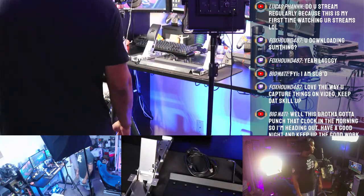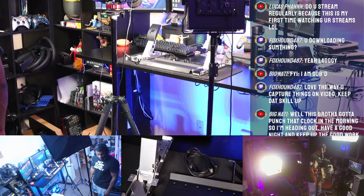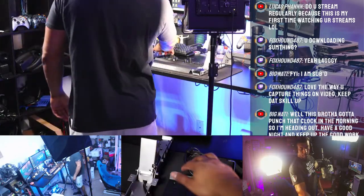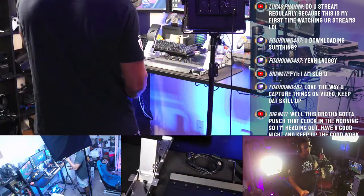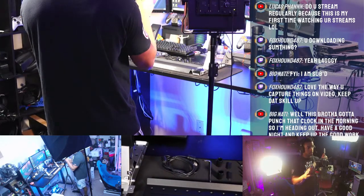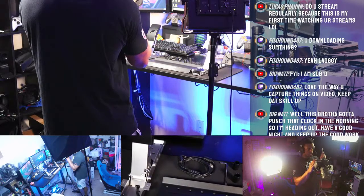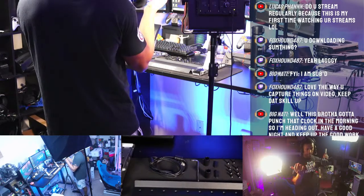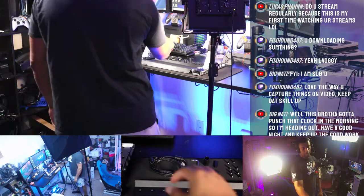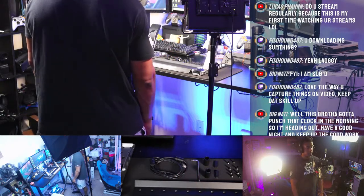One thing that has been a big problem for a lot of people in sim racing is dealing with EMI, electromagnetic interference, also grounding issues of rigs. You've got often very high powered motors with high powered magnets inside of them, permanent magnets, electromagnets, and they produce a lot of electromagnetic interference. So having chokes on any kind of cabling can be really, really beneficial.